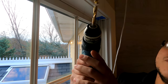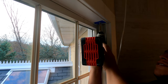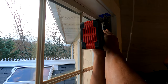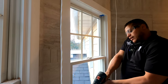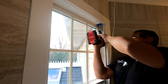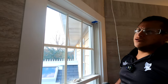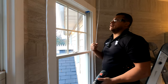We just went through one layer of the metal — you can see the metal crispies on there. Now we're going to try to shoot through the remaining metal layer; there's a little gap and then another layer. Pressure is your friend when you're chewing through metal — you need to apply pressure through the drill. I think I'm starting to hit the wood. You can tell what you're drilling through by the feeling — the proprioception of it — and you'll also see wood shavings or metal shavings, so you know where you are.